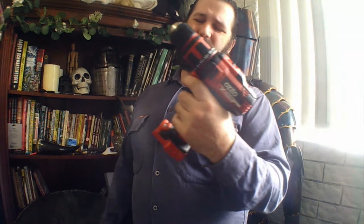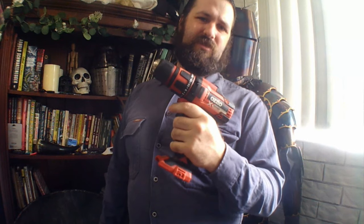You're also going to need a way to make holes. You could use a punch, but a drill works well and you probably already have one. It's a lot easier to change the size of a drill bit than it is to source a new sized punch. For holes, for a beginner - remember, always lubricate your bit.